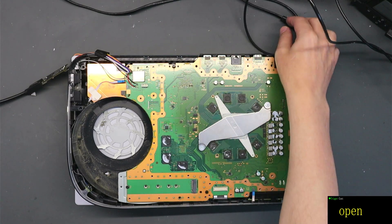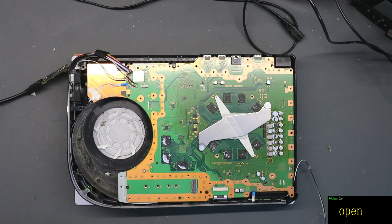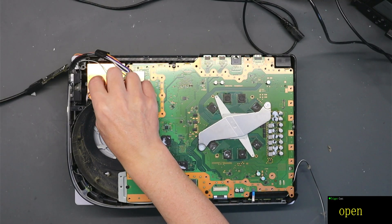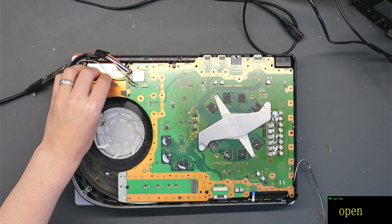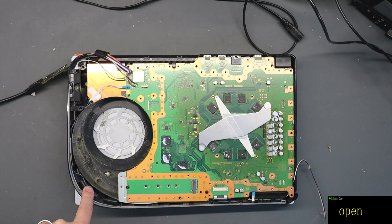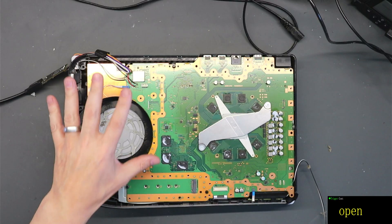So now if I plug everything back in with the HDMI port and everything, and power the console on without the LED ribbon cable, it actually powers up and displays. It actually does go to a white light - where it would go to a white light if I had the LED ribbon cable plugged in. I've seen this a few times before and it's normally when there's damage on the actual ribbon cable. Now this is a bit of a weird one because the actual ribbon cable was not damaged in any way, since the console hadn't been opened previously. So it's probably something on this PCB board which holds the LEDs - it's probably an issue with that. It's trying to boot up, pushes power to the LED board, and then shuts down the console.